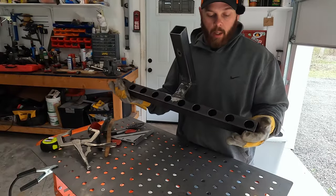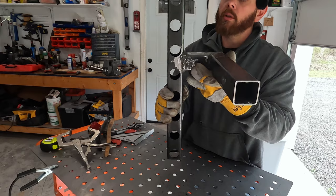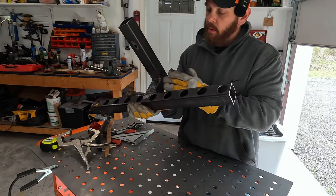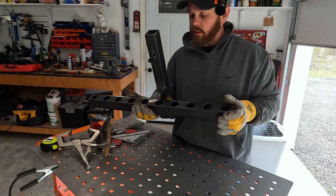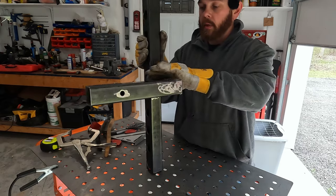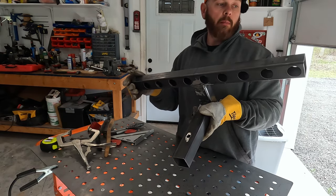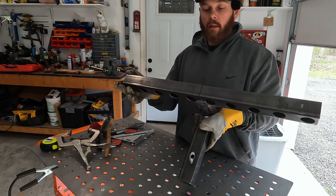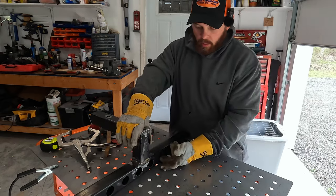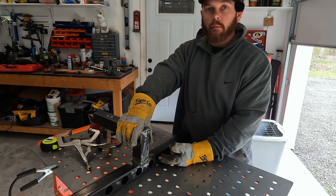It is all stuck together and it came out pretty good. Some of the welds look good, some don't look too great. I did a little grinding trying to get rid of the slag — there's a lot of slag with this flux core welder. I just grind out the slag so that when I paint it, it's hopefully halfway decent smooth. It fits pretty good, not perfect — it's a little off-center, which kind of bums me out, but I did my best given the situation. It'll definitely work. Now I need to figure out how to hold and support the bottom of these bars to keep them square so I can tack them into place.